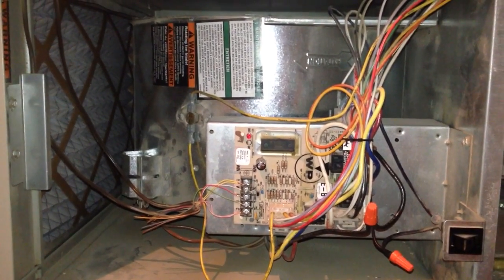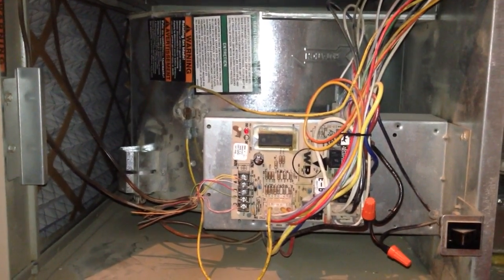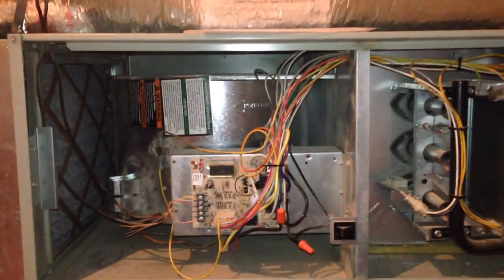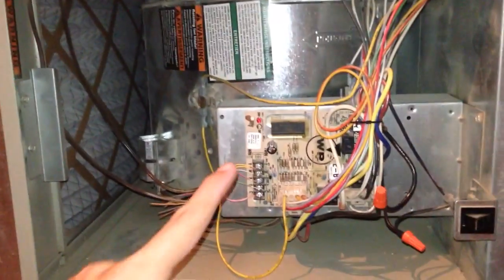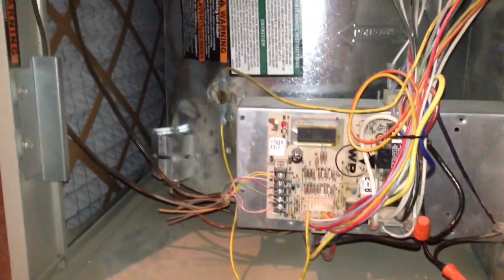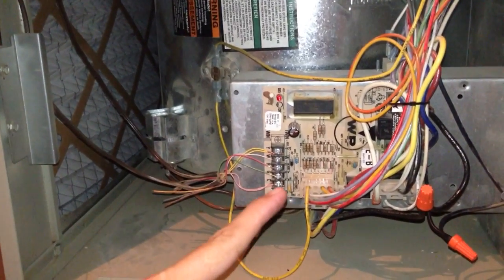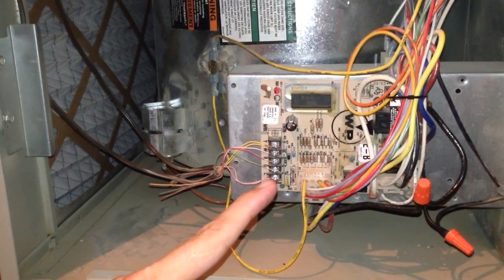In my two prior videos, I explained how I got the fan working on my air conditioner unit. This is the inside of my Trane air conditioner unit, the furnace area and the fan area with the circuit board area. I explained how I changed the capacitor. When that didn't take care of it, we knew that it was the circuit board causing a problem, most likely.